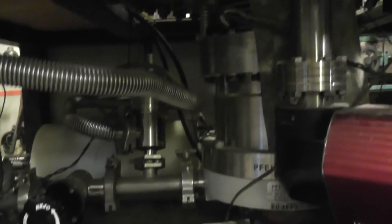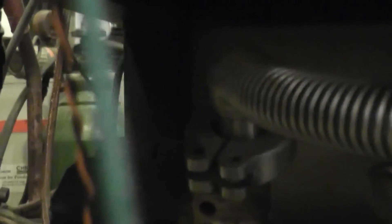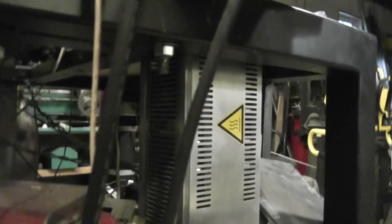The fore-line plumbing is all this coily pipe stuff and valves and whatnot. What we do during a run is close that big hand valve and use this solenoid valve right there to decide whether or not we hook the fore pump up — which is sitting there continuously running when we are — to the turbo pump and let a little gas out. The rest of this is just mostly trash.